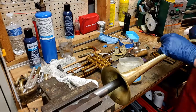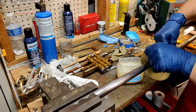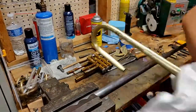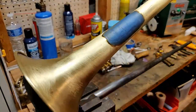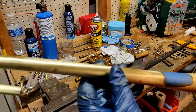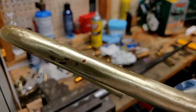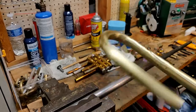I'm using the sandpaper in between to check how much progress I've made on the dents and it lets me guide myself to completing the dent. I clean this up one more time with the shop towel and some degreaser. These dents are about as well removed as I can get with my current tooling, so hopefully I can get some more tooling to better remove these dents on future projects. As you can see the surface finish isn't completely uniform and some of those dents are still a little bit present, but the overall look of this bell has been improved quite a bit.